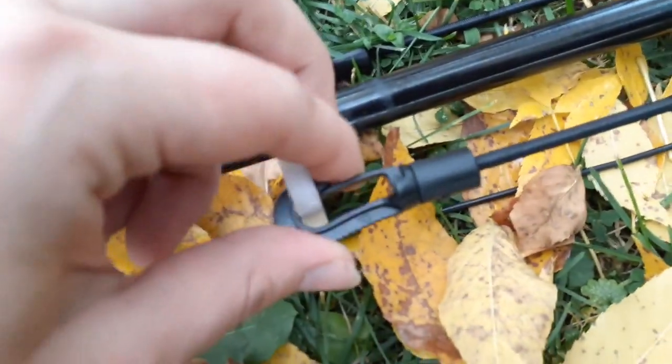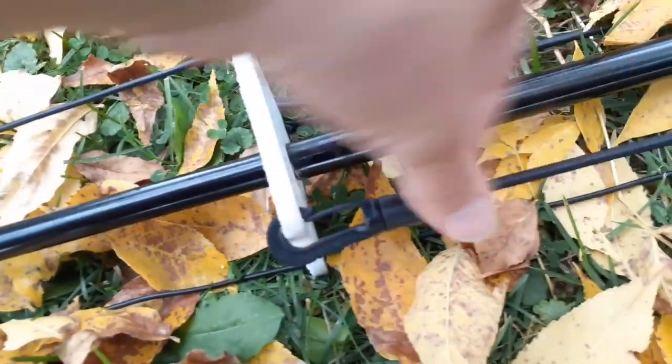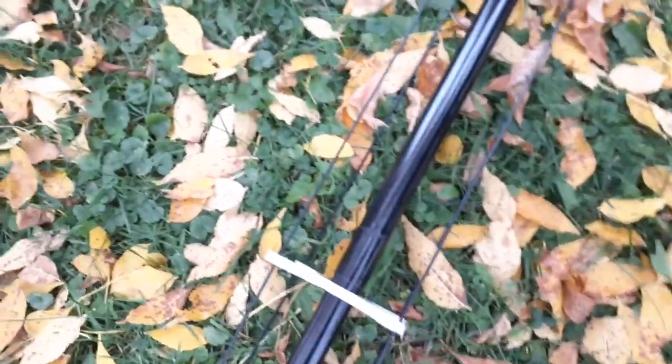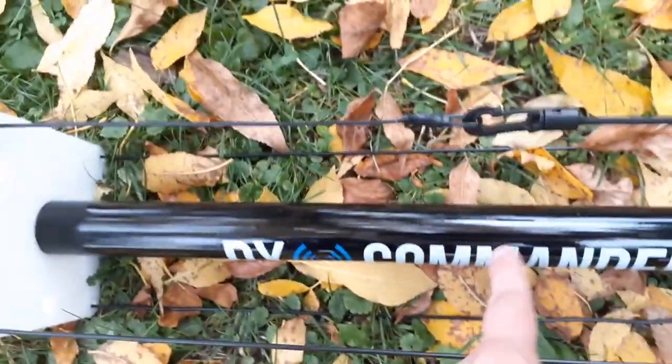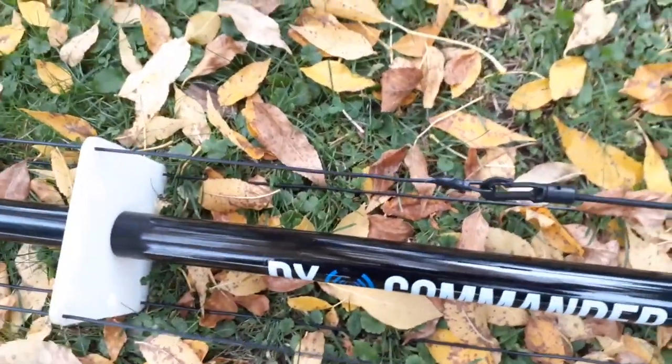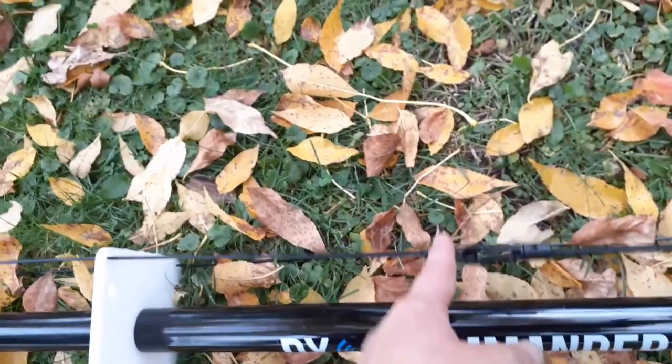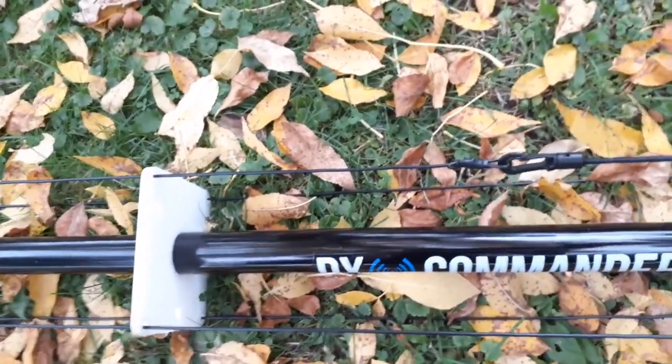The Jubilee clips: what you get is the little black cylinder at the bottom. You're going to pull your cord through, tie a knot, and then pull the knot down until it's inside the cylinder. The clip itself has two little hooks on the outside and they go into the black cylinder around the edge — and that's how they clip together. Not too hard. All you do is slide all the plates down and then connect all of the elements. The 40 meter element was the hardest — you can see it goes up and then back down. He gives a couple different measurements; just cut it until you get to where you want the SWR and which portion of the band you want. I did a one-to-one in the voice portion of the band because that's where I'm going to be using it, so I just kept cutting until I got where I wanted.